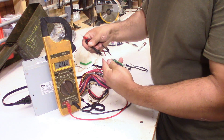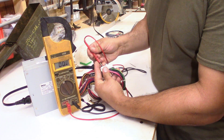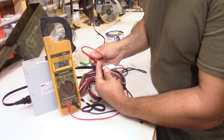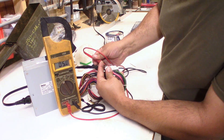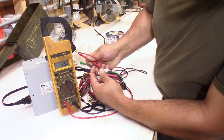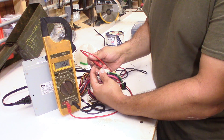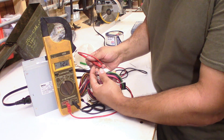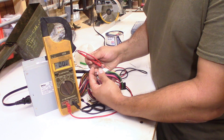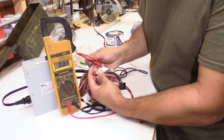I'm going to put it on any black wire and we'll do the red one first. The red one is 5 volts — you can see right there, red is 5 volts. The blue one is negative 12 volts. Now that's important — you don't want to mix that one up with positive 12 volts. The orange one is 3 volts, you can see it's reading 3.3 there.